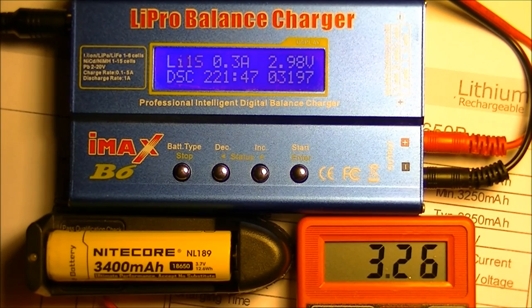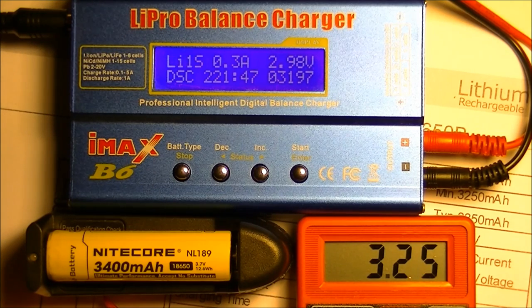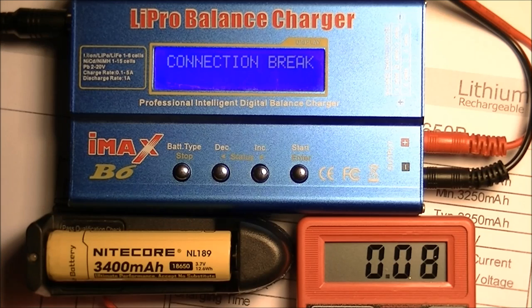The result from the standard discharge is 3197mAh — 86mAh less than the Olight and 56mAh less than the standard Panasonic. Now I'm going to discharge it below the 2.5V protection cutoff setting using the nickel-metal hydride discharge setting, as that's the only mode on this charger that goes below 2.5V. The cutoff circuit worked within spec — I saw another approximately 34mAh on top of that, making total storage down to that point around 3231mAh.